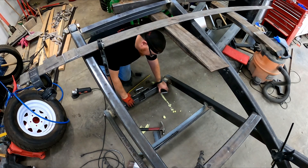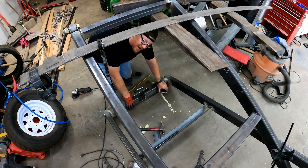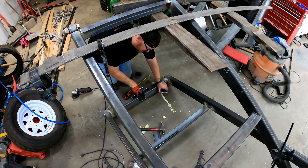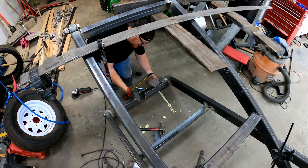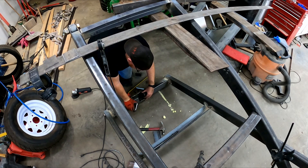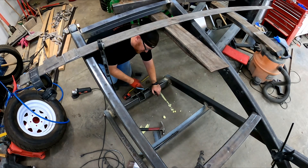In order to stiffen up this bar — because I wanted this to be a nice enclosed tube for strength — I needed to cut into here to get further back in. I also needed to cut some slots to be able to get this pin in and out and put its cotters in. So I'm just going to take and beef up this tube and kind of inter-skeleton it. The next step is going to be taking my two plates and setting them in here, then we'll weld those in. I'm going to match drill these plates, weld them together and match drill them so that the pin will be perfectly even between both.